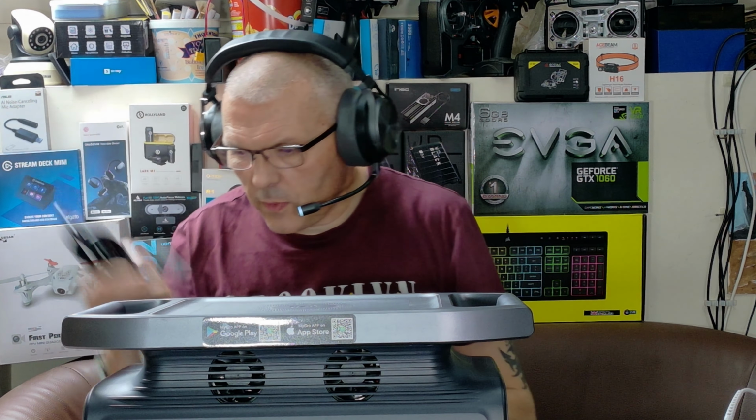Again, guys, if you're going to pick them up, it's up to you. I prefer the lithium iron phosphate because of the cycles. This is about 3,000 something. That's going to last you for years and years. And there'll be new things out, and you won't even use it that long. But it could potentially be used every single day for 3,000 cycles, down to about 80%. But what I suggest is, don't. When you cycle it, don't take it right to zero, then up to 100. Take it to 10, 90, or something. 80 would be better, but if you wanted to, you could go 90 to 10.